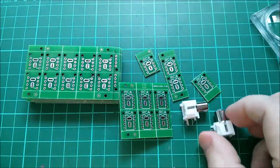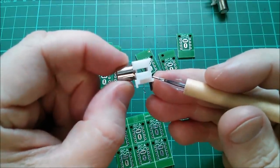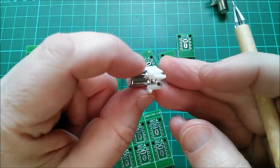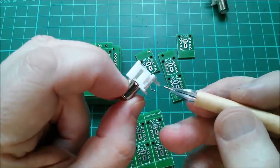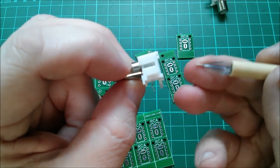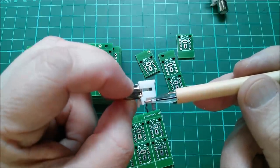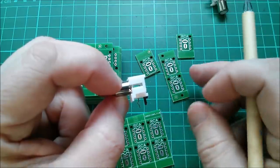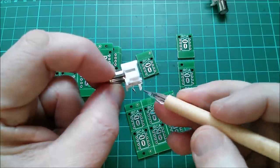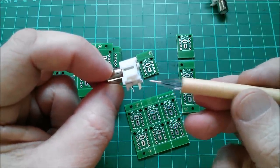Now the question is: do the RCA phono sockets fit into my pad design? Someone pointed out that these are very similar looking to the CUI RCJ043 connector, but I just bought these fairly cheaply on eBay. The CUI connector has that little barb on the signal pin, but it doesn't seem to have this little piece of metal sticking out the back, and I'm not quite sure why that's there. It extends down beyond the bottom of the connector. So these little square pegs have to go into the board, and that's why I've had two holes cut - yes, square pegs in round holes, but that's not necessarily a problem.